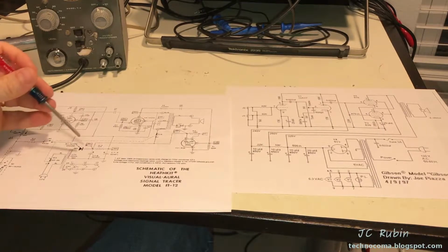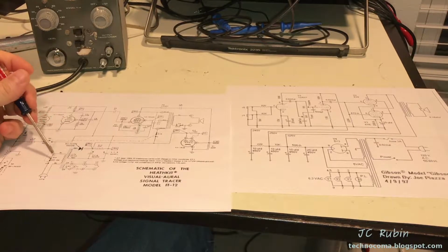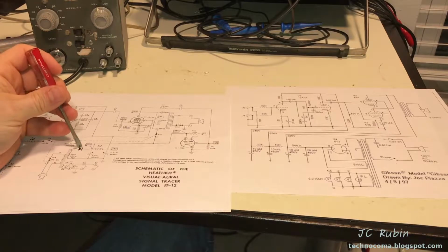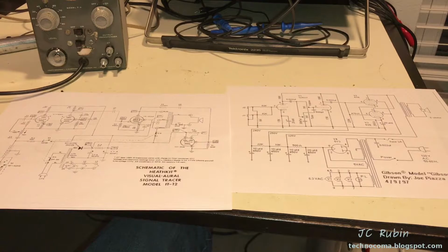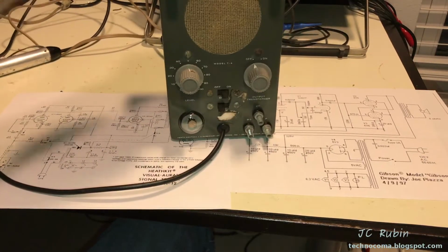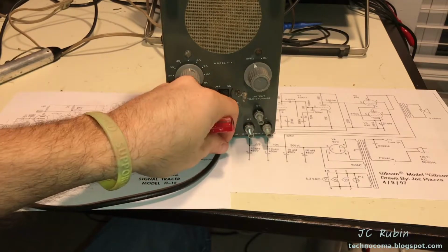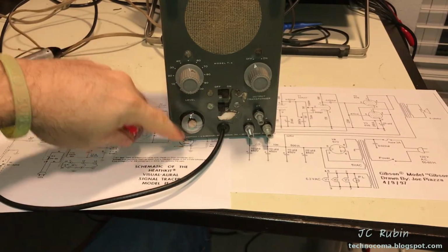Another thing that I'll point out is right now this one has that single rectifier. It says a silicon diode. I believe this one, however, is selenium. And this one will probably get the bridge rectifier just to reduce the hum, right? So a lot of thought's gone into this, but it's really all going to start opening this unit, snipping this cable. May not initially replace the jack, but snip the cable and just bring out the tip and ring on this as test points as I work through this.